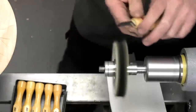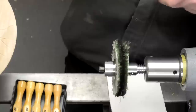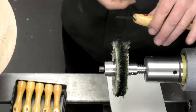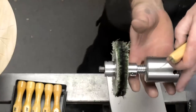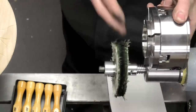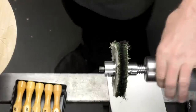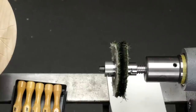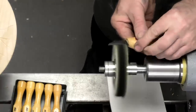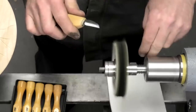Now this is the other major thing we said about, and when we first looked at this, an idea, could it mount in the chuck jaws? There's still a scope we might do one that mounts in the chuck jaws, but I was one of the people that went, that all gets in the way. So if you can imagine, you've got that big lump of metal sitting there, it's restricting where I can get into with the tool. So by having the narrower hub directly on the lathe and screwing it on and off as you need, I've got access that I can do both sides of that knife really easily. Nothing getting in the way, blocking my hands. Everything's nice and round on here.